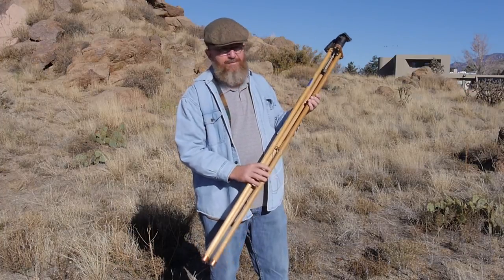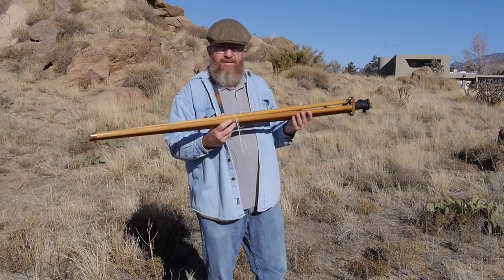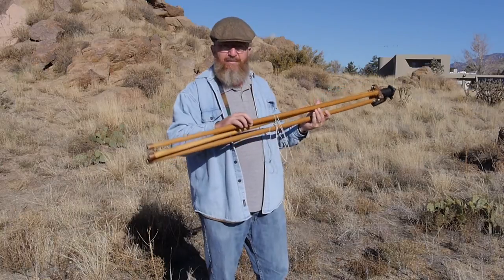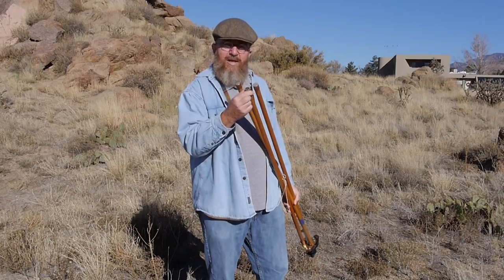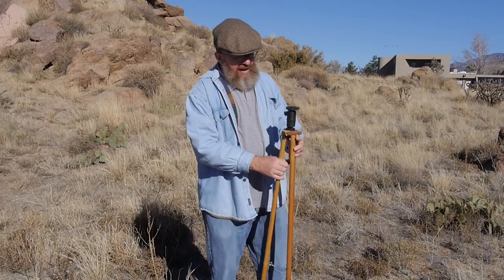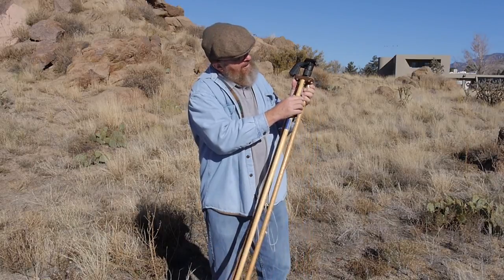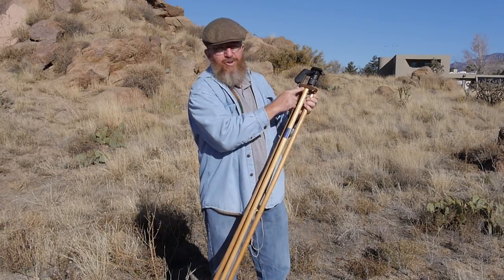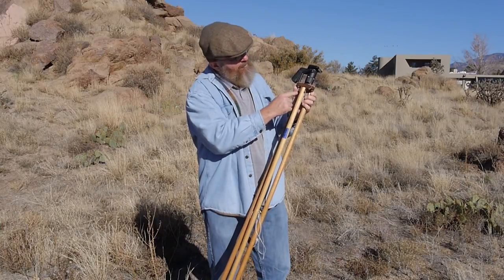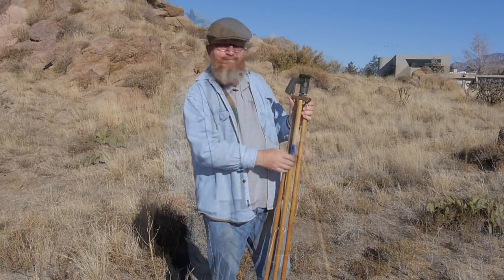What I have right here is one of my nicer little tripods. This is made from 48-inch long hardwood dowels — tropical wood, 7/8 of an inch in diameter. The feet are covered in 7/8 inside diameter copper plumbing pipe caps to protect the wood against whatever you find on the ground. The head is a triangle made from black walnut, and the legs hinge onto the platform with angle brackets, hardware, and nylon locking nuts.